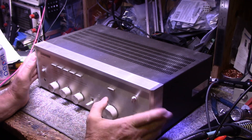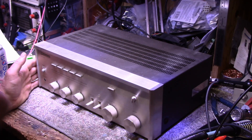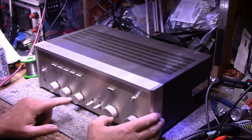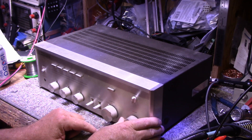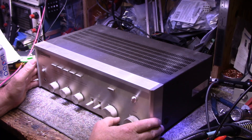I was using this amplifier because it sounds so good, but it suffers slightly. I hooked it up and plugged it in the other day to try it out and I couldn't even listen to it because it just sounds terrible. You've got dirty switches, pots are dirty, function switches are dirty. It sounded so bad I just had to disconnect it and listen to something else.